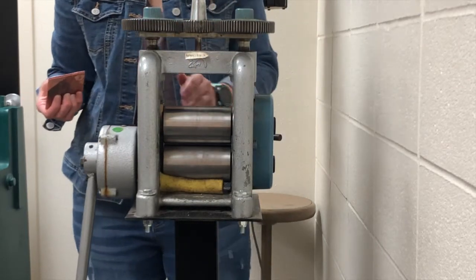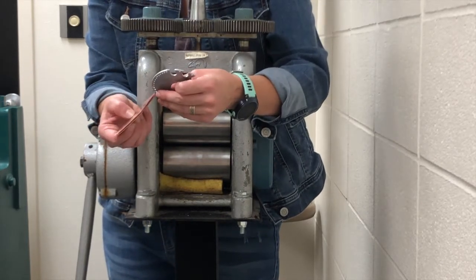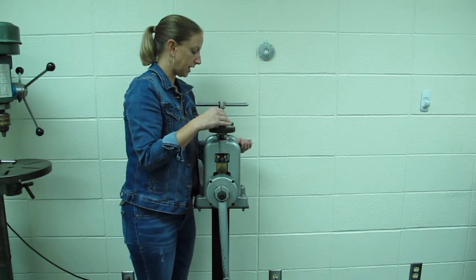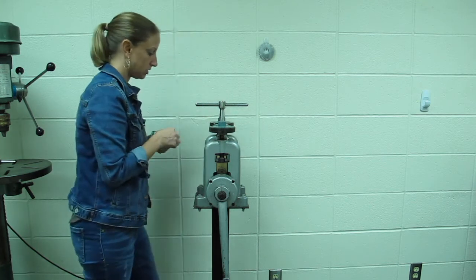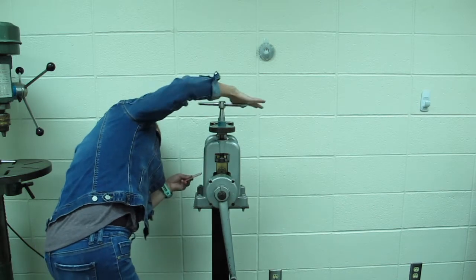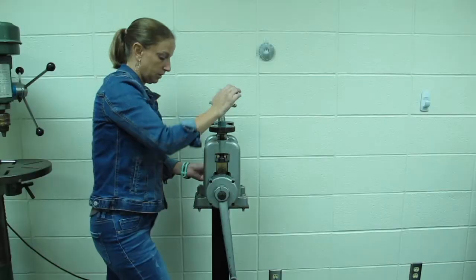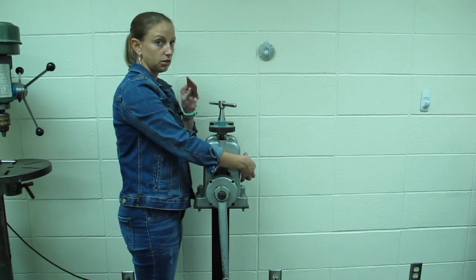If that texture goes on the rollers it stays forever and then everybody gets that texture — we don't want that. These are very expensive and hard to clean without creating more scratches. The gauge plate is sitting here so that you actually know what you're working with. I started with 18 gauge metal. With this rolling mill we have a number gauge on top that lets you gauge how tight it's going to be, so you can repeat this over and over again. I'm going to open my rollers until my metal fits all the way through, then close them back down until I can't pull it out myself, then back it out. All we've done is set the thickness of the rollers to the thickness of our sandwich.